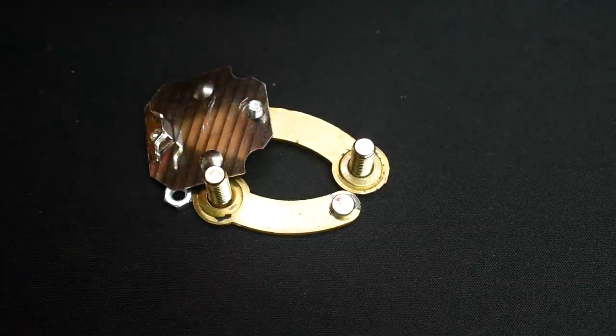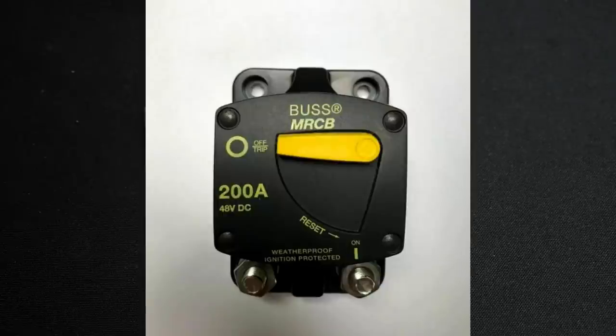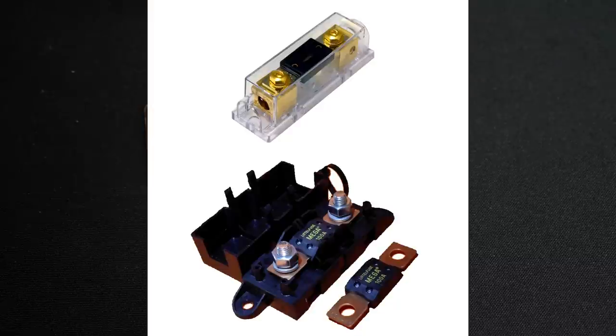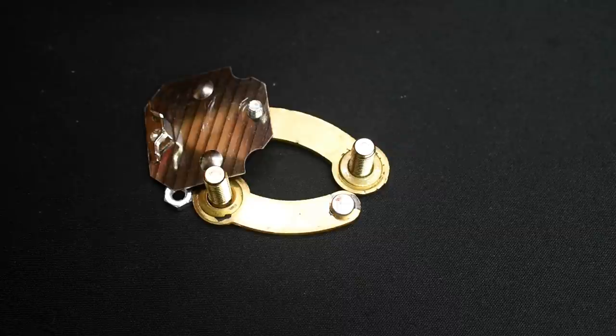So my recommendation would be: avoid these at all costs. Spend more money if you really want a circuit breaker — the ones that work extremely well are made by Bussman or Blue Sea. Friends of mine have had them in boats and RVs with never any problem. The only issue is they are a little expensive. If you don't want to spend that much on a breaker, then I suggest using a fuse holder with an ANL or mega fuse — very inexpensive, and if you size the fuse properly you should not blow it. Guys, that's it — I hope you enjoyed this video. If you did, be sure to rate thumbs up, share, and check out my wide range of videos. Thanks for watching.